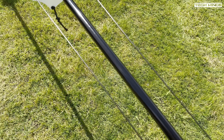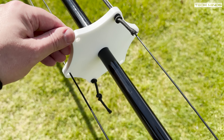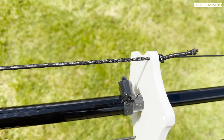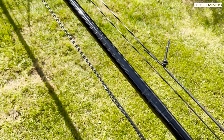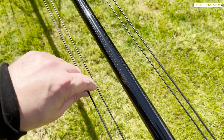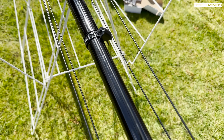As we go down the pole, just make sure all of the stopper knots are holding correctly — the last thing we want is for one of these to slip out once the antenna is up in the air. Putting the Signature up and taking it down is extremely easy due to the slide-over ground mount and a single connection from the SO-239 to the driven plate.